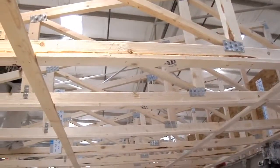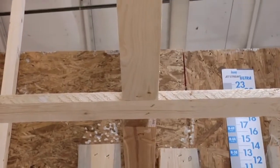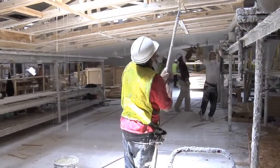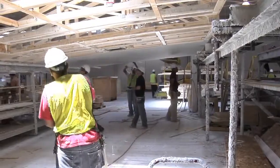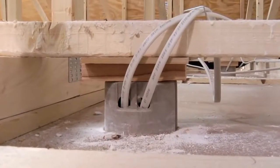Solitaire ceilings use 1x3 material that is glued and stapled flat along the bottom of all the 2x3 roof trusses. Longitudinal 1x3s also span the entire length of the ceiling. This type of roof construction provides a large area for ample gluing and the hand nailing of the half-inch sheetrock ceiling. All light boxes are braced and secured so that ceiling fans can be installed in any location throughout the home.